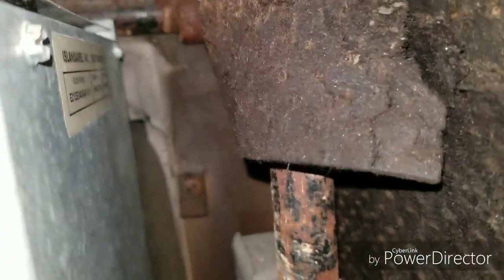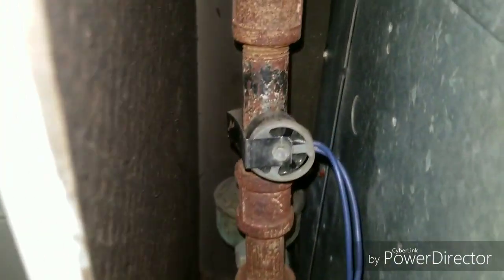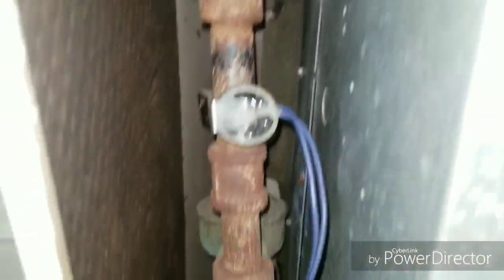Okay, here's the second unit. There's our piece, and the unit we just worked on. That aquastat has a clip, so that's good. Alright, pull this guy out — I got him out. And you just push that piece in like that, and it's nice and tight around the edges. Push the unit back in, make sure your steam valves are open, and reattach your aquastat on the return line.